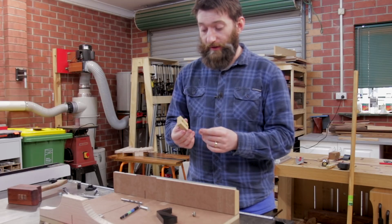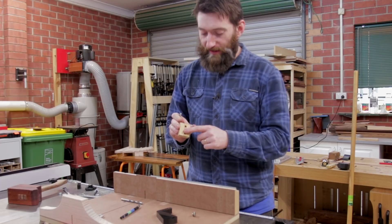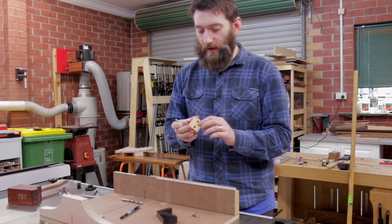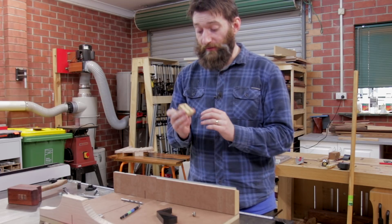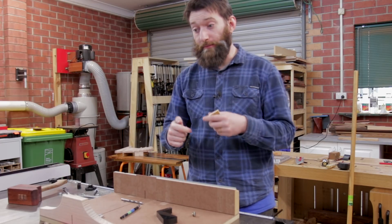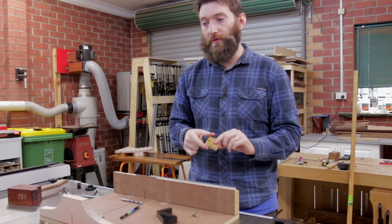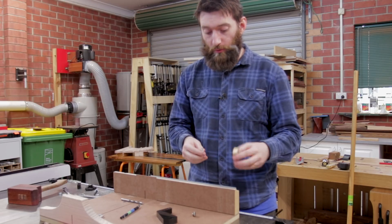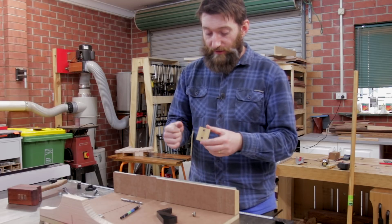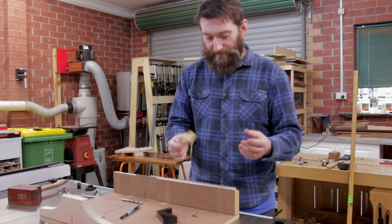There were a couple of errors I had to correct using some hand tools, but they were all design issues. First, the stem that goes into the T track — more importantly the areas that got carved away — I had set that to two millimetres deep, but on this T track that extended down past the lip. So when the T track bolt was being pulled up it was resting on the underside of this, making a poor connection that would wobble. I just planed off a little bit with a block plane and we were in business. The other issue was I made the stem just a hair too big, but again a block plane and some sandpaper fixed that up.